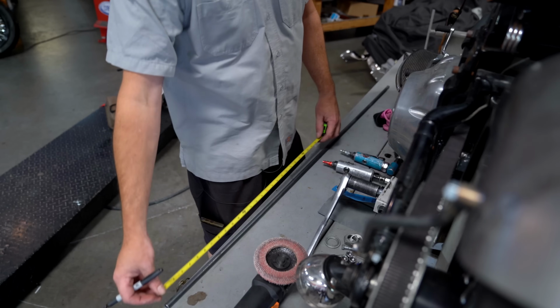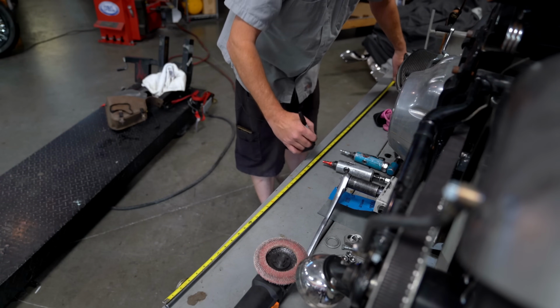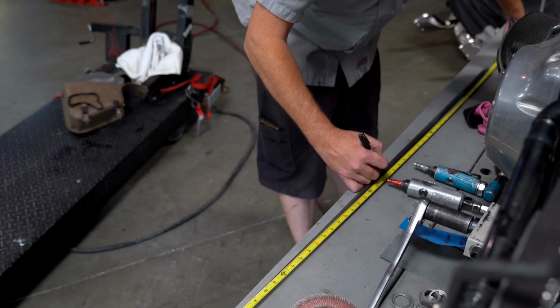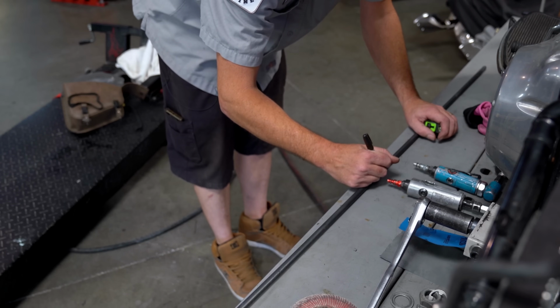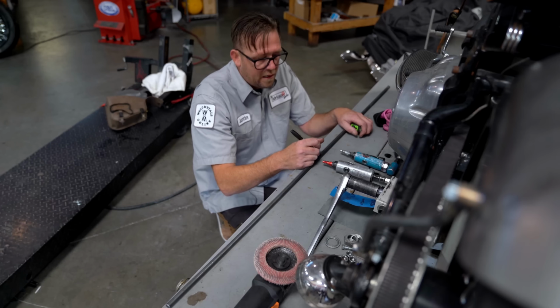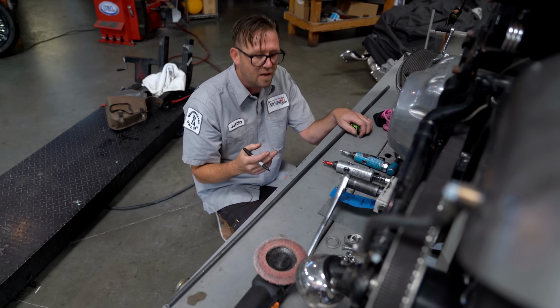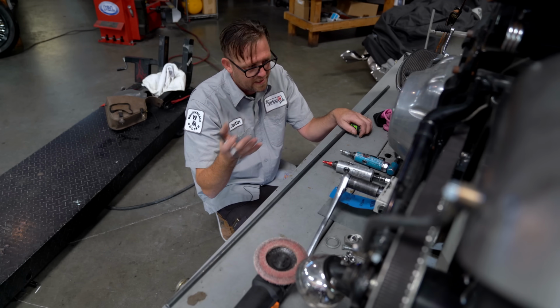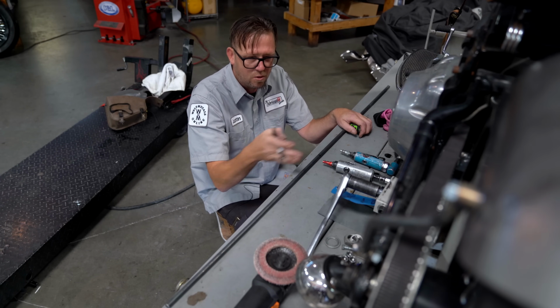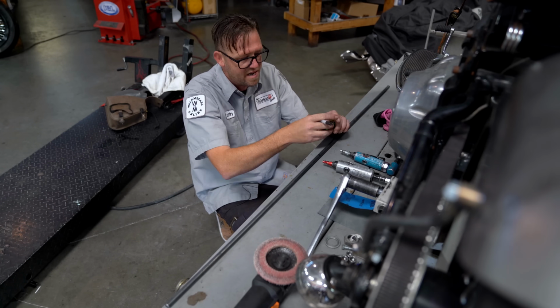Okay, so the rest of this is going to be used for the whole sissy bar. It's like 54-ish inches, so we're going to start with half of it, about 27. I need to make sure the halfway point's pretty visible. I was told that we want a radius around the top, as Steve put it, a beer can radius, so that's roughly 3 inches. The circumference of that is like 9.5 or so, and I want like a quarter of that because we're only bending roughly halfway, not even that. So a quarter of that is roughly 2 3/8.